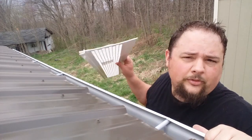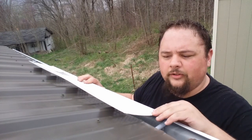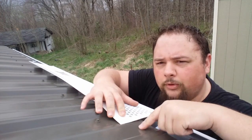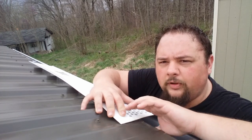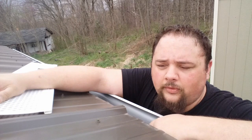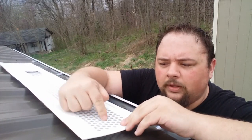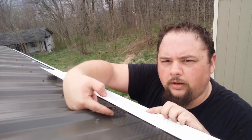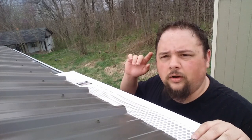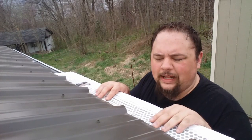But I'm learning that these Amish-built buildings are not built with the foresight of having gutters installed. I was supposed to put this underneath the roof first and then install the gutters, but there's just too much space — too much of this has to go under the roof for me to get it up there and still snap onto the gutter. So I'm going to have to loosen the bolts to get this underneath the roof so the water flows on top of it. I learned my lesson on the other side, which is completely finished.